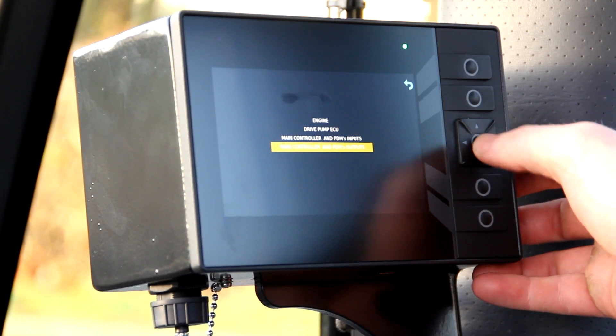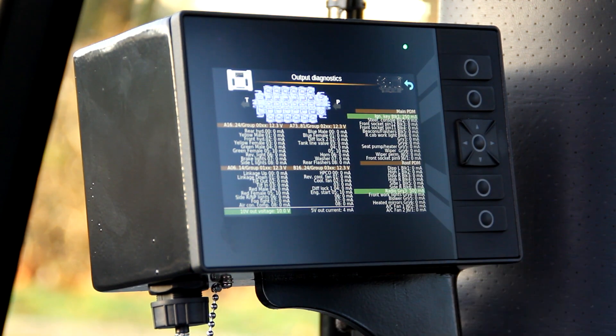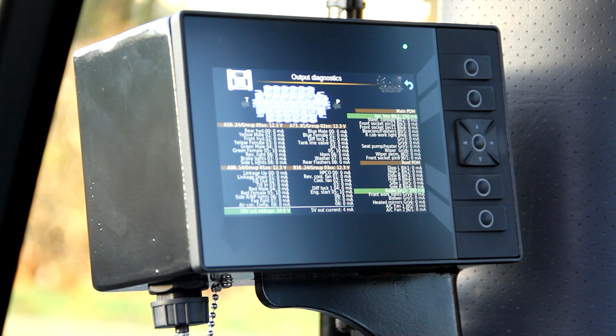Going to the outputs page, at the top you'll see an image showing the main hydraulic valve block. This is a really nice feature — I can get live information on the display: if I move my joystick, the valve that should be active is highlighted; move it the other way and the same valve in the other direction is highlighted. It will also show the current going to the solenoid in that valve, so you can see if it's getting the right amount of current — making it much quicker to debug and reduce machine downtime.